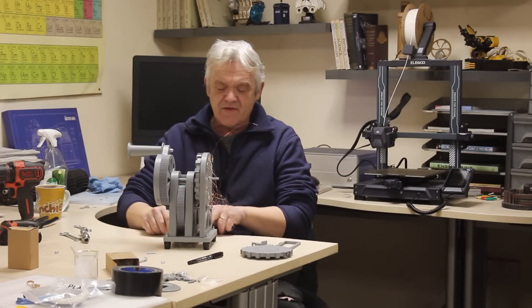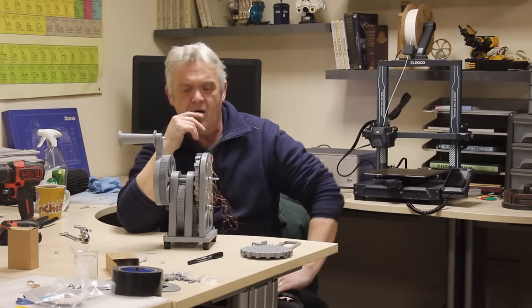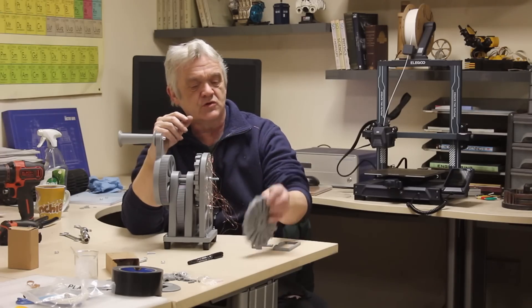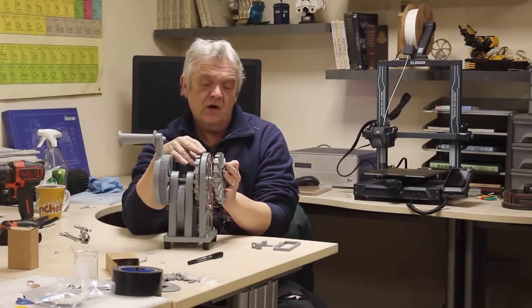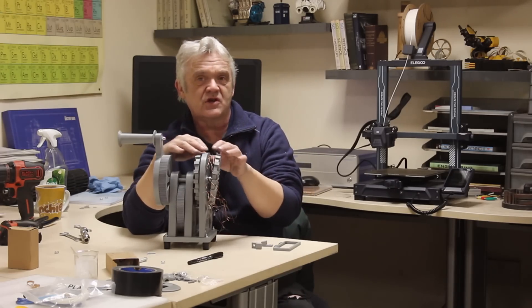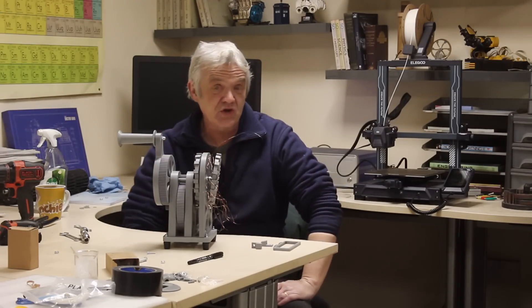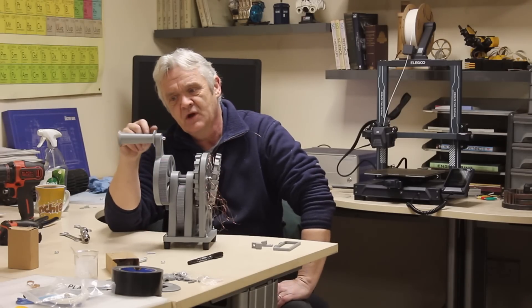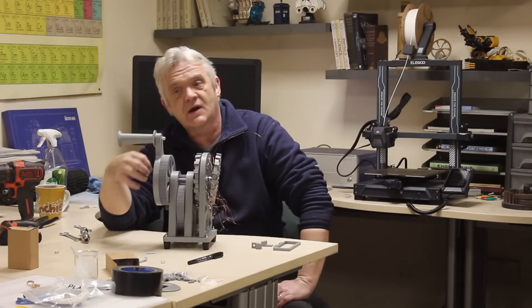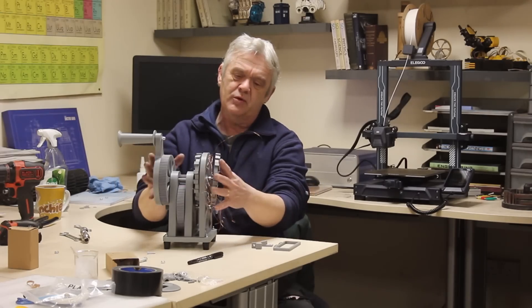So that's it basically together. I've put little feet on it. When I turn the handle, that will spin like Billy-O. It will generate even with just the one rotor side on, though it isn't quite finished. I still have to put the other side of the rotor on that bolt and tighten it up with spacers until it's a nice distance from the stator. Then we'll have an axial flux generator — a hand crank axial flux generator. I've done a separate video on removing the hand crank and adding holes to attach it to a wind turbine or water wheel.